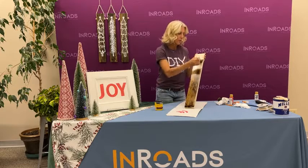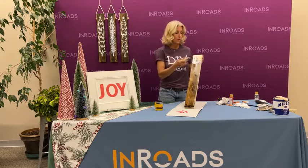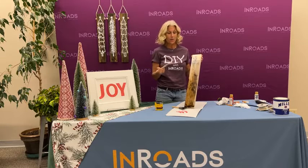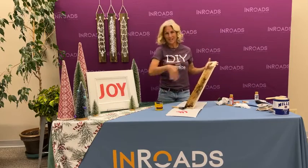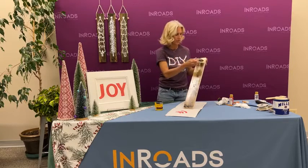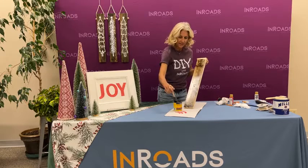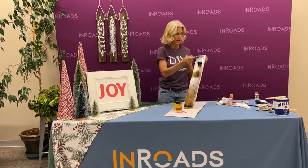Plus, I also like to use the foam brush on this because the stain is much thinner than paint and it splatters. So if you use, say, this brush, okay, make sure you're outside. Because even when you're indoors with the drop cloth, it's going to splatter. And it's going to splatter on you too. And you don't realize it until afterwards, and you have all these little speckles all over you. That's why I like the foam brush, it contains the stain, and it's easy to spread out. And plus, once again, these brushes are nothing, like a $1.99 or something.